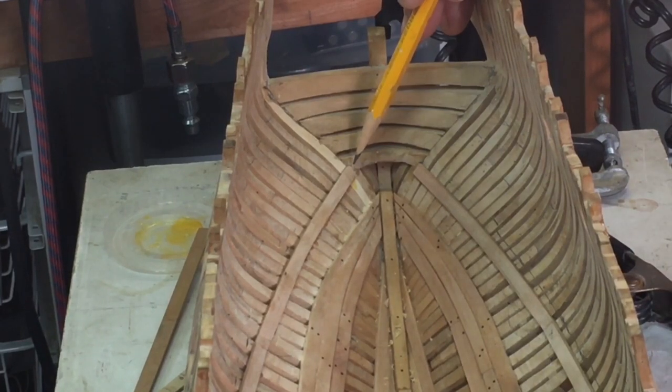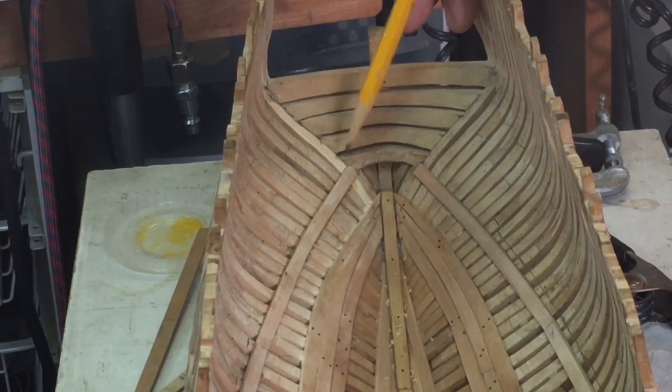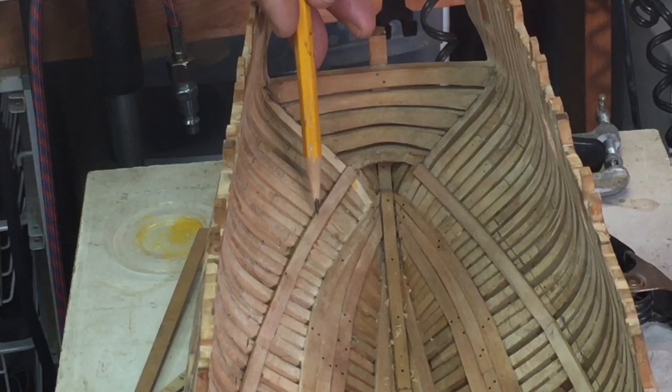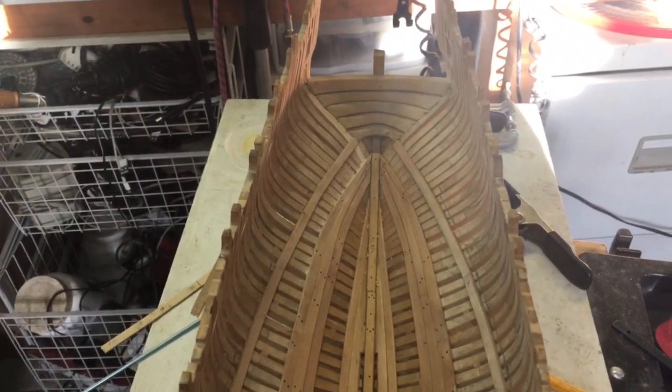And now one of the key challenges, where 15 meets the stern. I have located it 6 inches up on the fourth piece of the wing transom, and it goes right across the first aft cant frame, number one. It's tapered to 10 inches at the stern and reduced in thickness from roughly 7 feet back down to 3 inches.